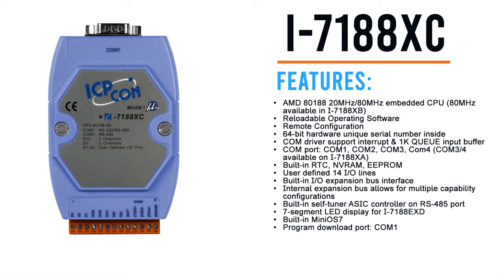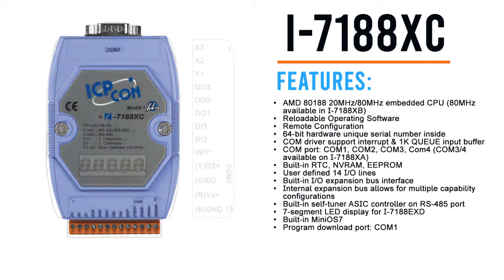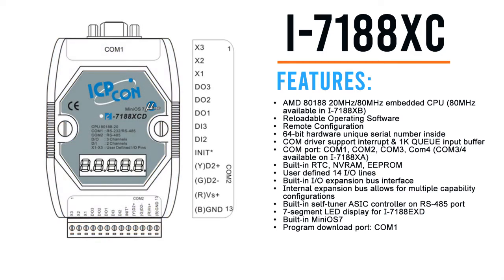It can be used in a vast quantity of applications. One of the most popular applications involves controlling proprietary equipment which communicates using serial commands or Modbus RTU protocol through either the RS-232 or RS-485 port. The programmer can use the demo program examples to read data from their equipment and trigger DO alarms or provide control decisions based on the closed-loop system and feedback from the equipment.